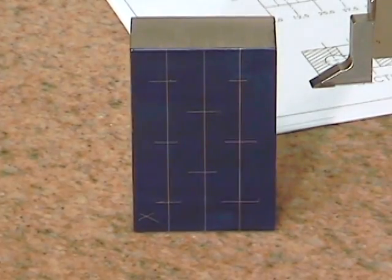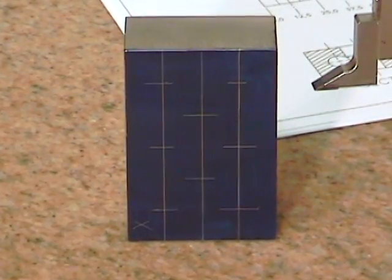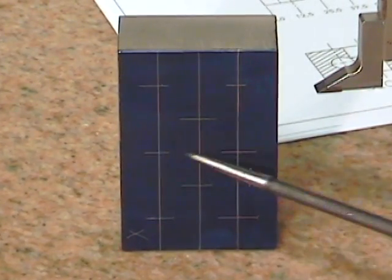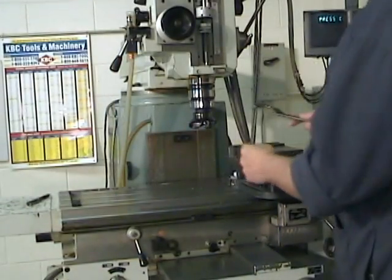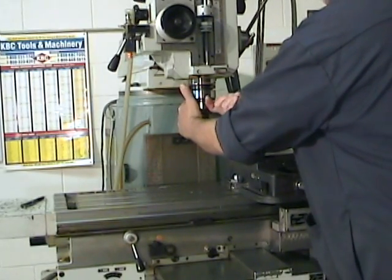And there we have it, our layout lines. We can see the X that indicates our reference corner, and we can see where each hole needs to be produced. Use the long line short line technique to ensure that there is an intersection only where there's going to be a hole, because unnecessary intersections create a lot of confusion.